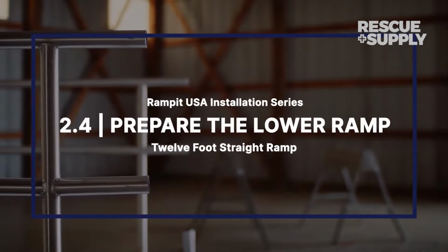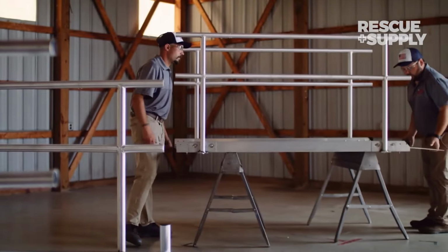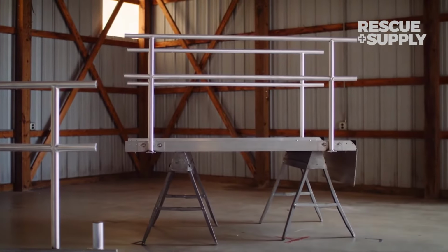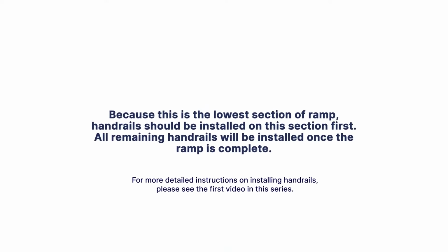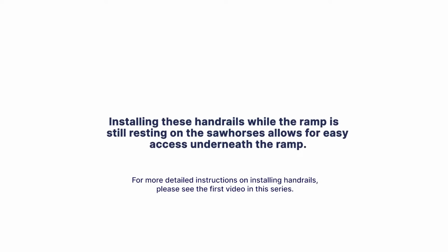Prepare the lower ramp. Locate the next section of ramp and place it on the sawhorses for assembly. For the purposes of this video, this ramp section has been pre-assembled with handrails. Because this is the lowest section of ramp, handrails should be installed on this section first. All remaining handrails will be installed once the ramp is complete. Installing these handrails while the ramp is still resting on the sawhorses allows for easy access underneath the ramp. For more detailed instructions on installing handrails, please see the first video in this series.